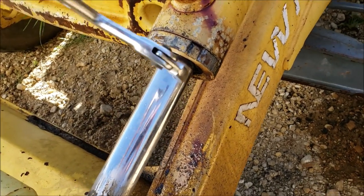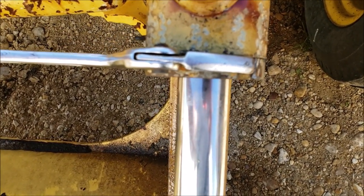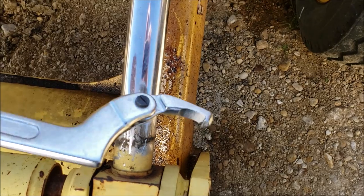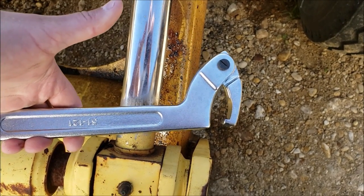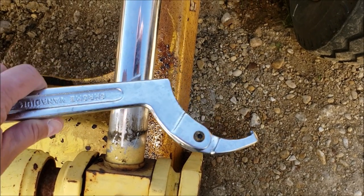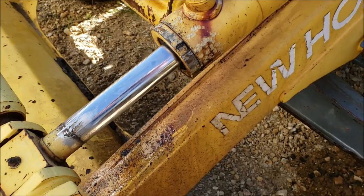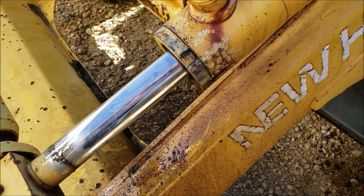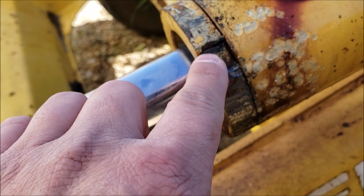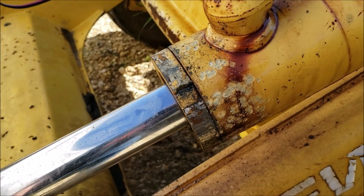This one used the spanner wrench type. As you can see, you just hook the spanner over it like this. This one's an adjustable one that goes from about two and a half inches to four and a half or something like that. They're not that expensive — I think this was like 20 bucks on Amazon. I wish I would have started with this instead of the pipe wrench. But it was on very tight, and even the spanner wrench couldn't get it off — it was actually just eating off the metal from the lip. The spanner wrench was just ripping it off. That's how tight this thing was.